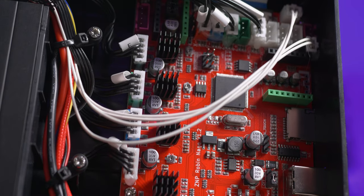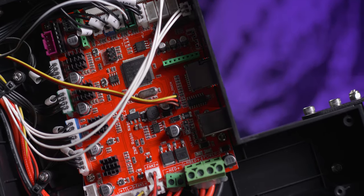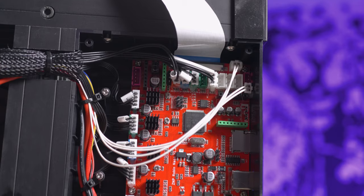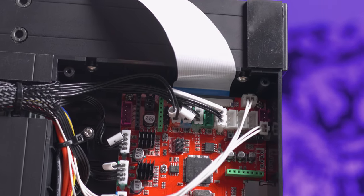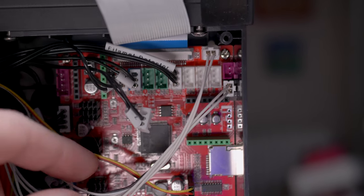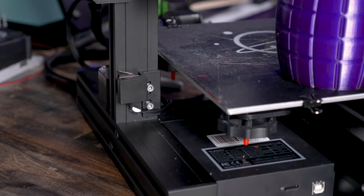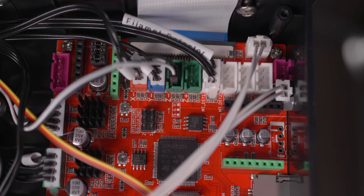We don't have enough length with my harness anyway to snake along with the other wires. The three-pin connector from the harness has a brown, yellow, and red wire on it — that is going to the BL Touch port. The yellow wire from that harness should line up with the S terminal on the BL Touch port, which in my orientation here is the top terminal. I should make a quick note that I had the LCD removed from the machine solely for filming purposes so I could get a clear shot for you folks — you don't actually have to do that. We only have one more connection to make, and that is the black and white two-pin wire connection. Along the top of the board you will see a handful of connectors — those are your different end stop limit switches. We're looking for the Z negative, Z minus — that is your Z end stop, the switch at the bottom of your frame next to your bed. You can remove the Z end stop switch from the machine entirely when running the auto bed level sensor, as it will use the sensor as the Z homing switch. We're going to unplug that one and plug the BL Touch two-wire connection into that port on the board.